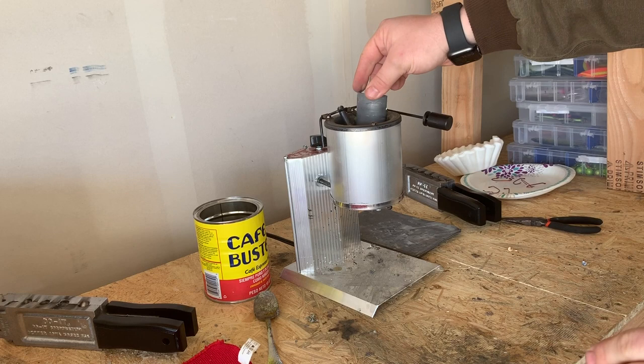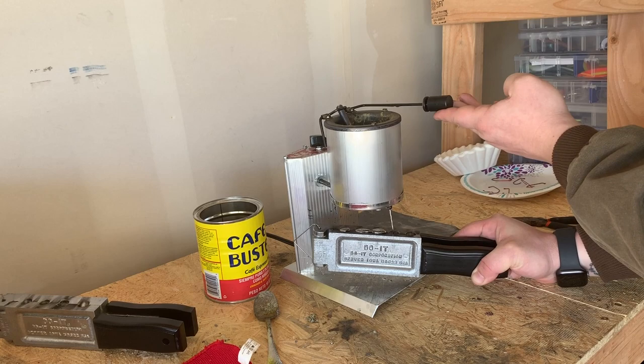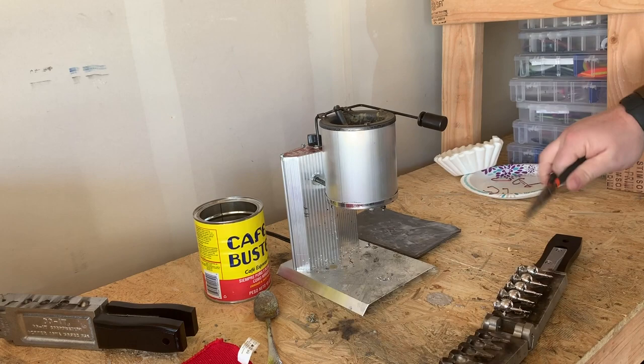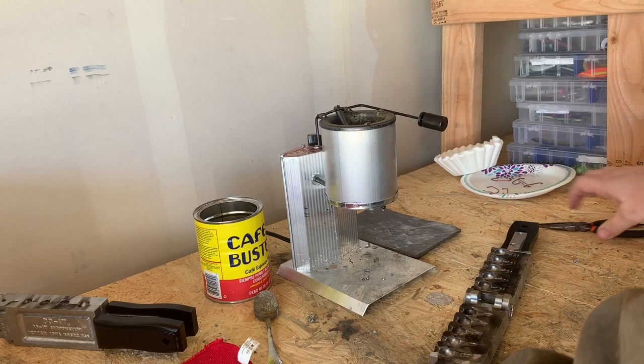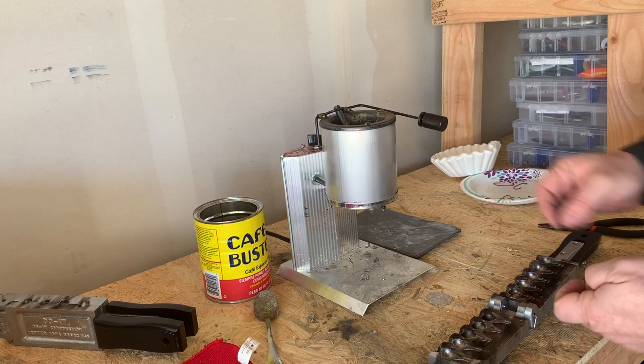When you're adding lead, just stand back and make sure it melts how it's supposed to — there can be splatter, especially if it's not pure lead. Give it a minute or two and make sure everything's good. Now I'm heating up this production jig mold and pouring all five cavities, since I'm planning on using all five. I'm loading up the hooks and getting ready to pour. Some molds like to pour different ways, and I'll show you what I mean while pouring these round ball jigs.